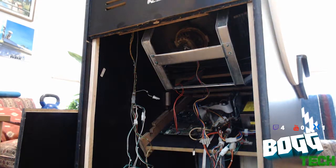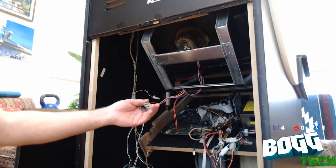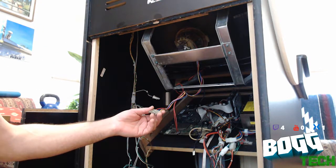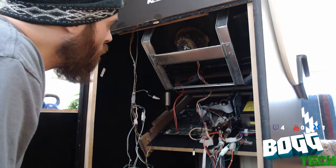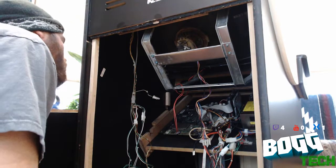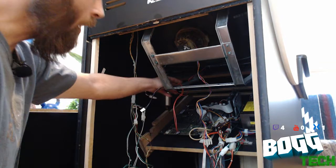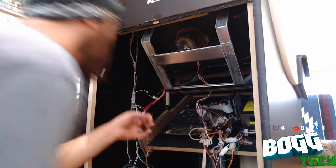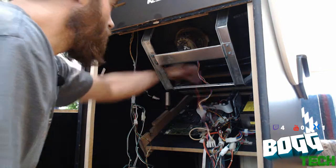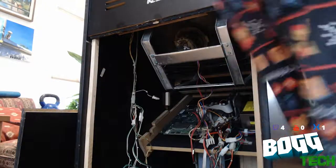Yes, well, 4 or 5 things to plug in. This is the yoke connector. That controls the windings around the yoke that help with focus. We've got the ground. This goes to the neck board. And we've got this positive. This might actually be for degaussing. And what we need to do is feed that panel in there. At the same time, I'm also going to slide this control panel out, give myself a little bit of room.